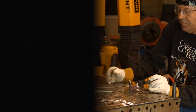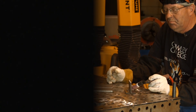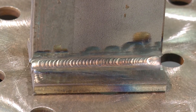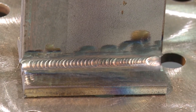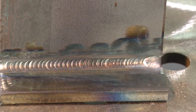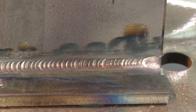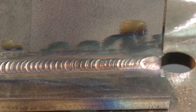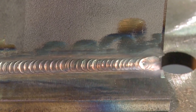For those of you watching that subtle technique: we got about a quarter of an inch away from the end and started decreasing the amperage, adding filler wire, and then pulled back through so that we don't blow that corner up at the end of the weld. Those of you that know me well know I don't like blowing up corners and creating undercut back there.